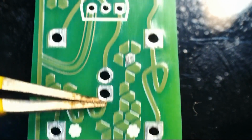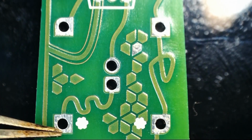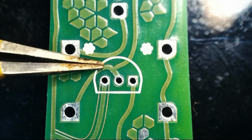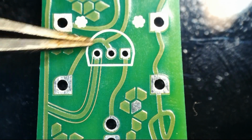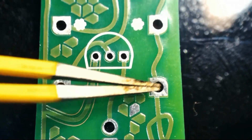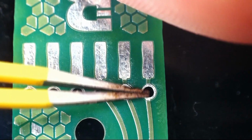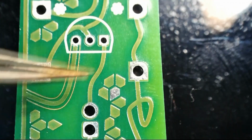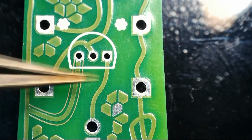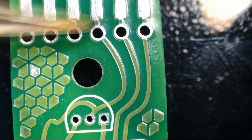and this is an LED. So that presumably would be the positive side of the LED, and that would be some resistor to limit its current. And then that LED would be pulled down to ground through this transistor when the transistor is on. And so what turns on the transistor? Well, this would be pulled up through a resistor from the opposite side. And then where else does that go? It's also connected over here. So it looks like what happens is when you put two of these together, kind of reversed 180 degrees, so they cross over when they're with resistors, then you connect power to either board and they both light up, but then you can ground these pads, well, not those pads, these pads here.